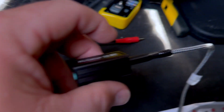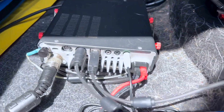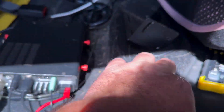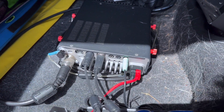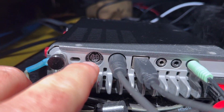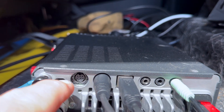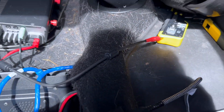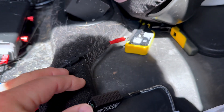I'm in the truck now. As you can see, I have USB-C connected to the Digi Rig, and on the back of my 891 I have the USB cable that came with the Digi Rig — that's the red one. I have the six-pin DIN plugged in, and that DIN is different than the DIN beside it — that's the black one. The DIN isolator for direction finding is on top, and on this one the DIN is actually in the middle. So it goes: USB here, six-pin here.